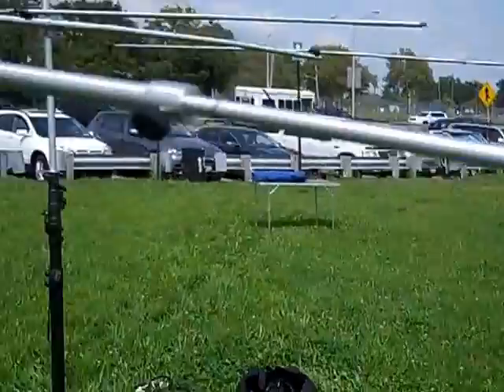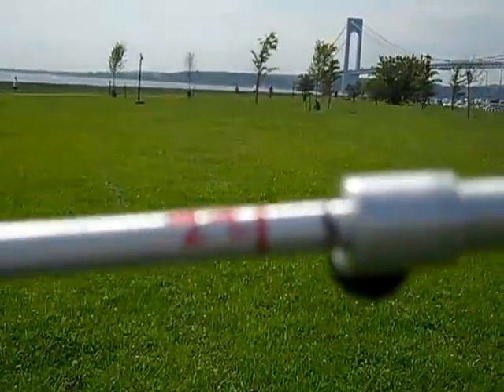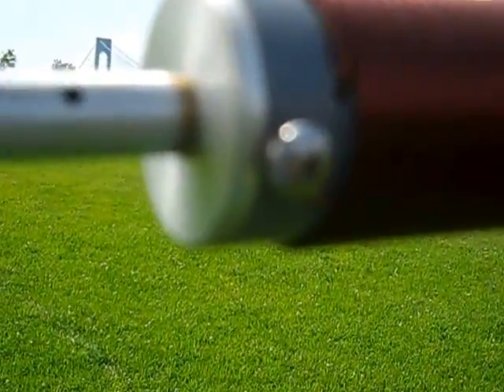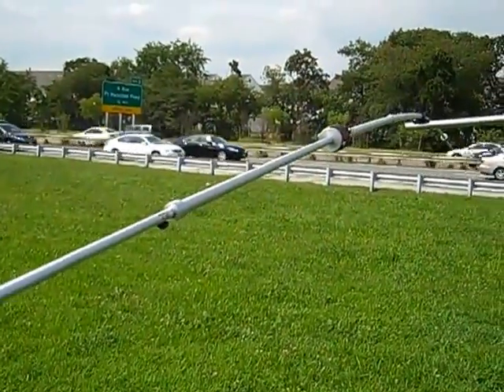Since I don't have the antenna analyzer, I'm going to have to use an antenna tuner and dial it in a little bit and pray for the rest. Construction is going very nicely. For example, this director element should be marked for 20 meters — I believe it's 22 inches, which is the red marking you see here — but I pulled it out about half an inch to compensate for the screwed portion inside the 20 meter coil. Just be careful when you do the markings. I know I need to add about half an inch to three quarters of an inch to everything to get the right length.